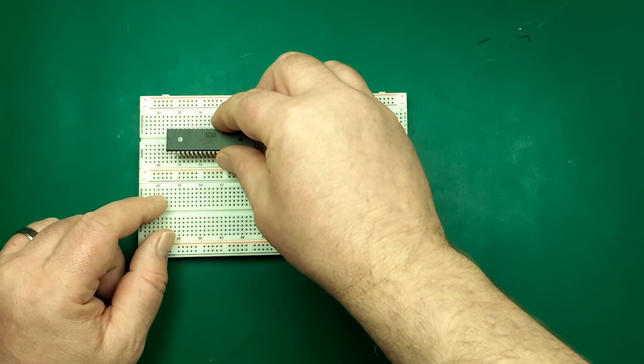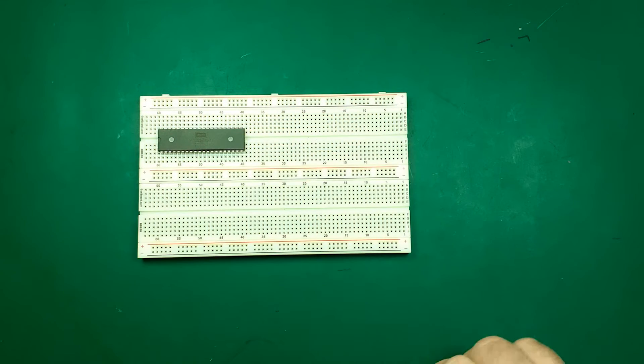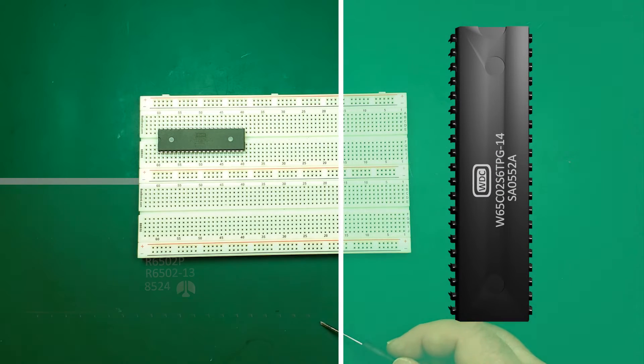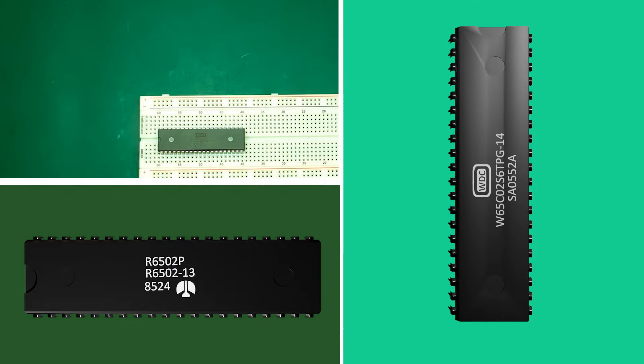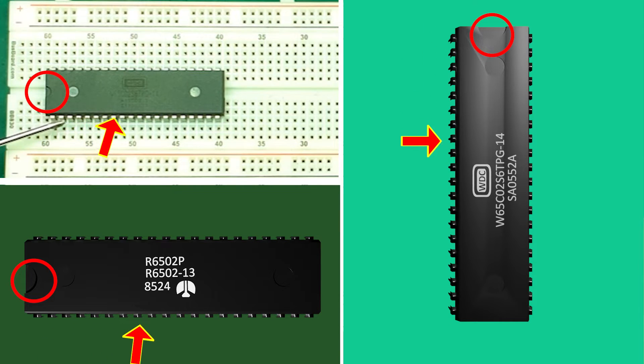Let's put it into a breadboard and look at the various pins and how we could connect them to a basic system to get it up and running. I'll make a copy of this 6502 and also add in the original 6502 so you can see the pin differences when we go through them. Pin 1 seems like a logical place to start. Every chip has a top notch to indicate the top of the chip. The first pin on the left is pin 1. You count down to the bottom — in this case down to 20 — and then count up from the bottom right, in this case going up to 40.